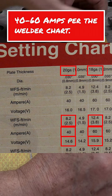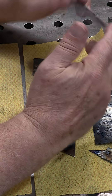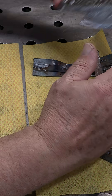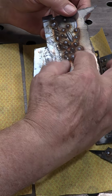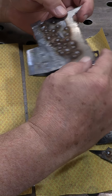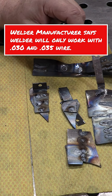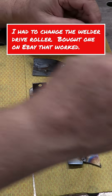But my experience has been that when you're doing that, a lot of times that's not enough amperage and you end up with real high beads but not much penetration. So I did some testing. My welder says it can't work with it, but what I am running is .025 wire.